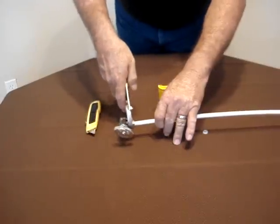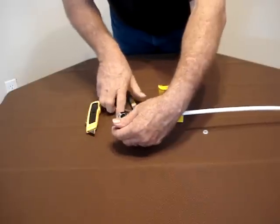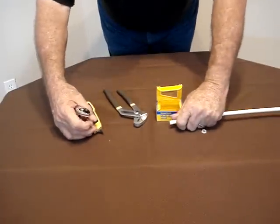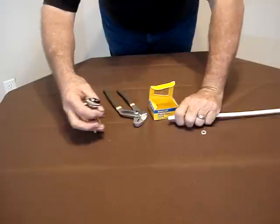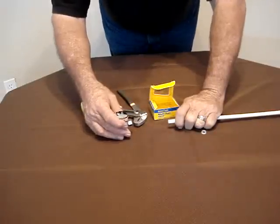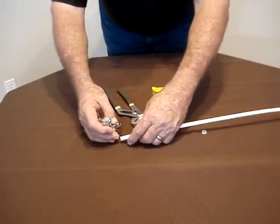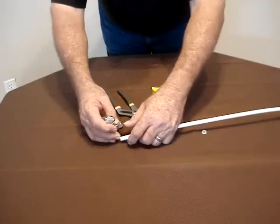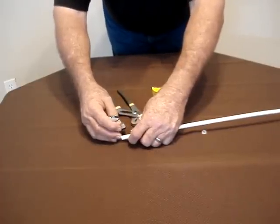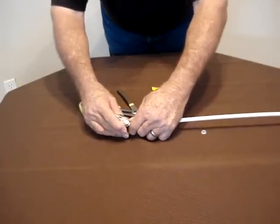Putting a pair of channel locks, turning it one half turn so that it's tight. And see what it does — it breaks apart. The result of this test is that the brass compression fitting will separate from the PEX pipe. The second test will come next.